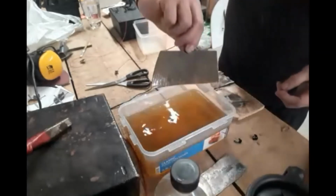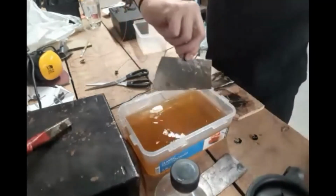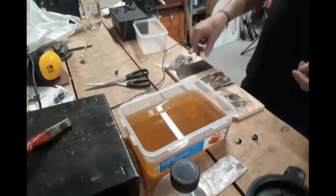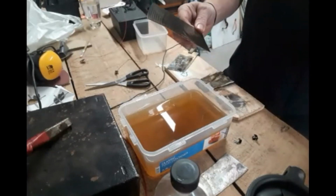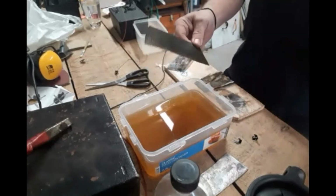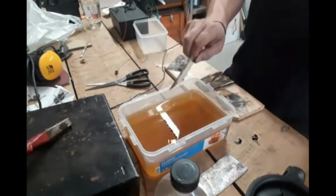You can see that our plate that we put in the cathode again has gone black, front and back. Incidentally, if you're doing a lot of etching and you leave the same cathode in, and it keeps going black, the blacker it gets, the less efficient it is. So you need to either keep taking it out, scrubbing it, cleaning it, or replacing it.